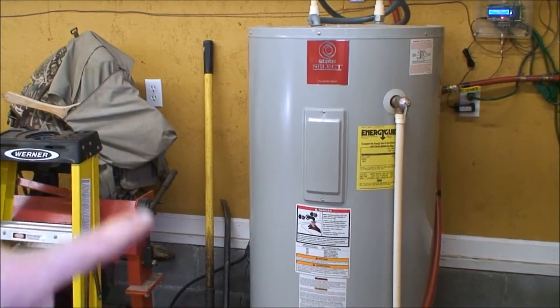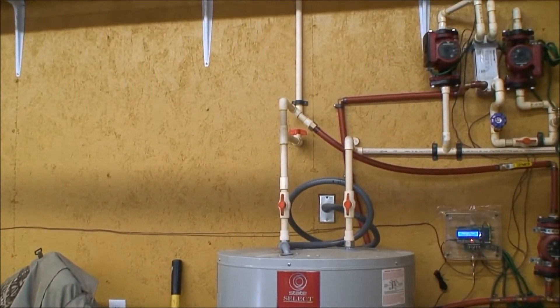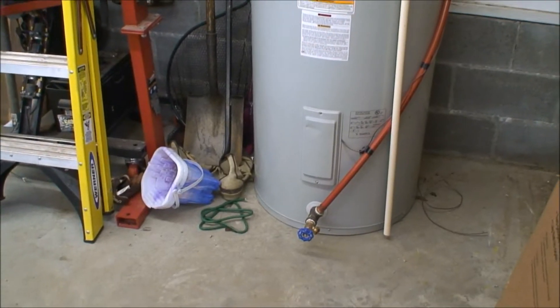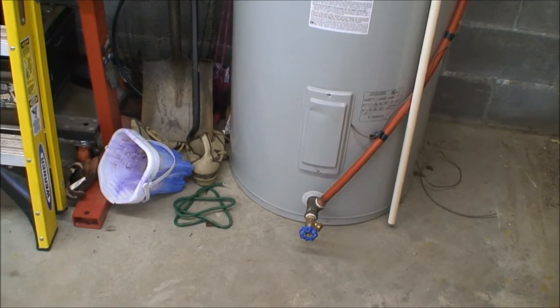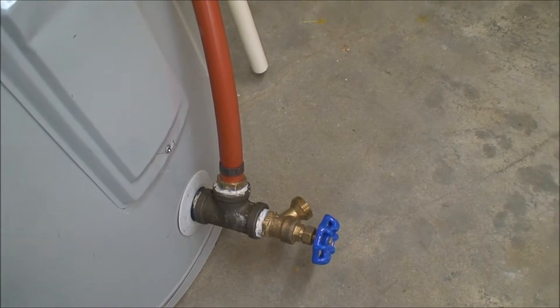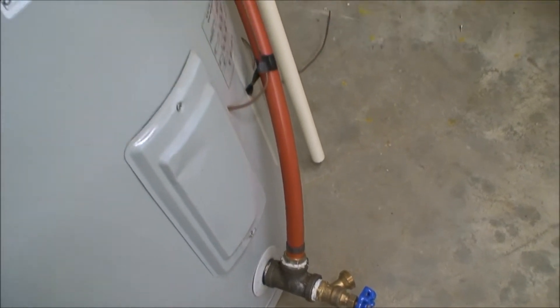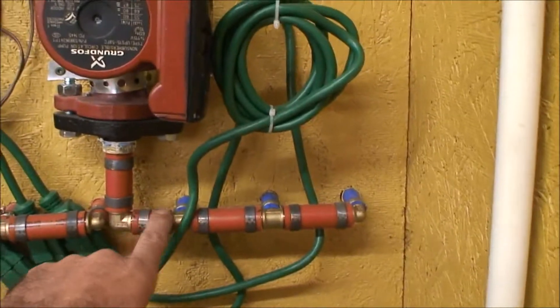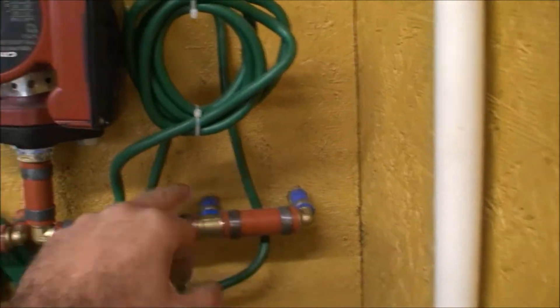Here's my system. This is my 80-gallon hot water heater. You can see all the plumbing — it's kind of ugly right now, I'll fix that later. Basically what I did was I took the drain valve out of the hot water heater, put a nipple in its place, added a tee, and put the valve on the outside so I can still drain it. That's how I'm tapping into the cold side at the bottom. On this side I've got my hot water tapped in right here, with an on/off valve in case of a leak. It comes down into this pump, which runs into my solar heat grid — these three pipes here.